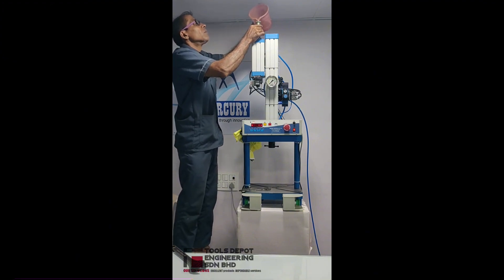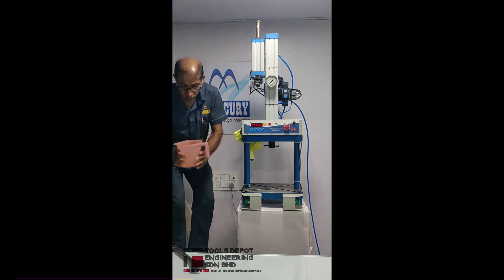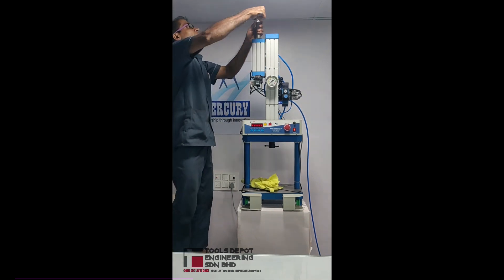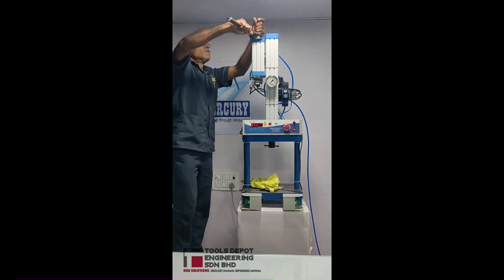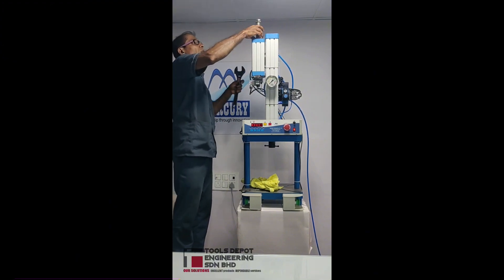Check if some more oil can be filled in — it has taken a little more oil because some air has escaped from the system. Now the oil is filled properly. Put back the oil fill plug, tighten it, then take the main nut on the threaded reservoir shaft back to its home or top position.